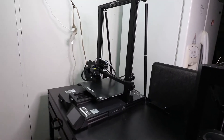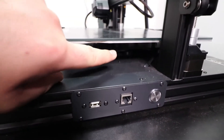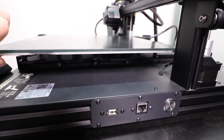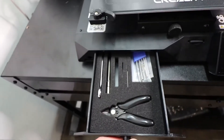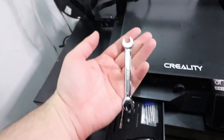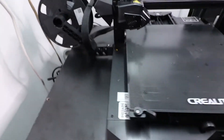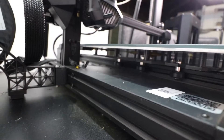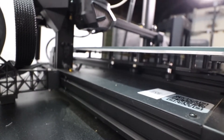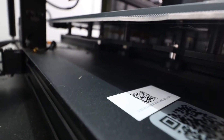So if you're getting wobbling with your hotbed, there are three wheels here — there's one right there, one in the middle, and one there as well. All of these are adjustable with the tool set that you've been given, particularly the larger side of this wrench. Another thing to note is that there are three wheels on this side as well.